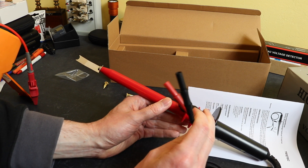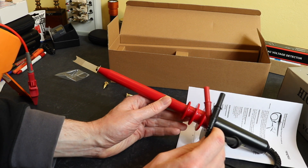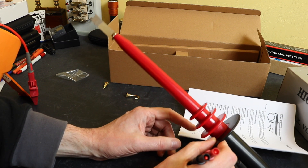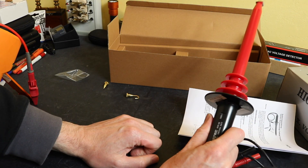There is no isolation between the meter point and the high voltage circuit, so if something fails in this divider you can end up with high voltage through onto your test instruments, or even worse if you happen to be holding something. Generally when I use this it tends to be a hands-off approach, although you can hold the probe if you want to.